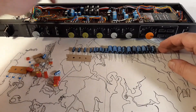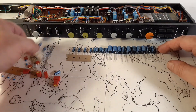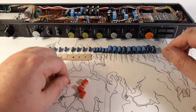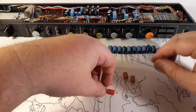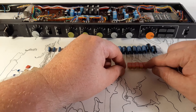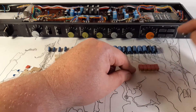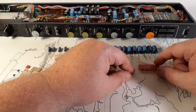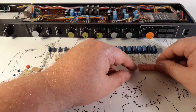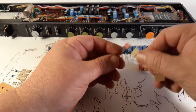There's a preamp circuit, the EQ circuit, and a line output circuit. Then I've got these 33 microfarad 25-volt caps — that's just a feedback circuit — and two of the 3.3s. The coupling caps in the original Yamaha are tantalums, but I prefer these Wima caps. Wimas are full of tone because they just keep whatever the sound is — they're so neutral. The Wima MKS2, and I've got five of these: 3.3 microfarad 50-volt at 10% accuracy. The rest of the film caps are 5%.